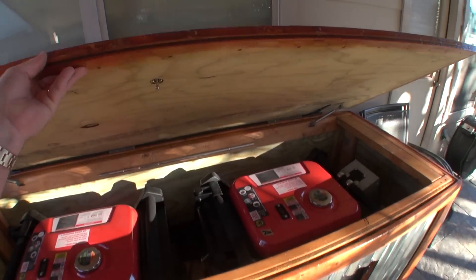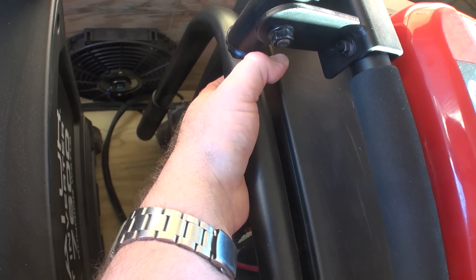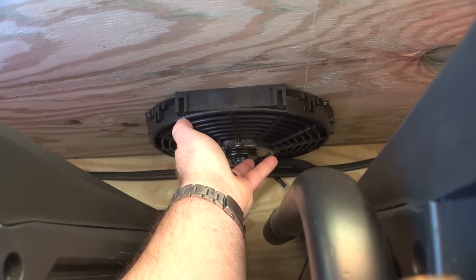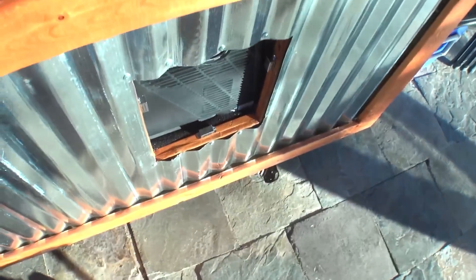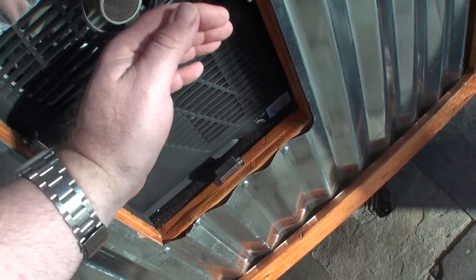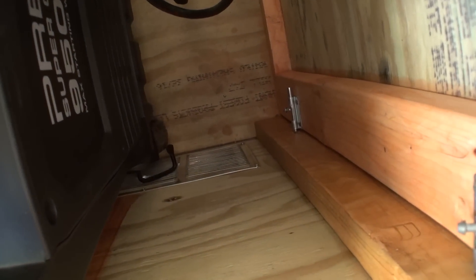A pair of inverter generators teamed together in an enclosure. The enclosure is actively ventilated with 12-volt DC automotive fans that plug directly into the front panel of the generators. Because the generators are drawing a significant volume of air through their enclosures, by making a reasonable seal around the output and the exhaust, it also helps to pull air in from the enclosure and assist the fans, working with a strategically placed vent.